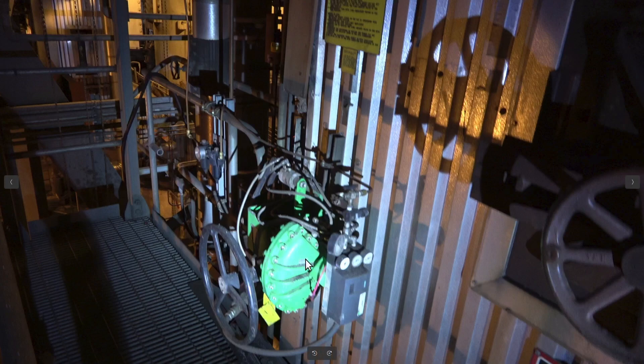This is the flow control damper — it regulates the airflow through the pulverizer based on the fuel and coal being pulverized. There's a minimum ratio; something like 60,000 pounds of coal requires about 160,000 pounds of air, depending on the coal and what you're grinding, but it's definitely a controlled ratio. If you get it too low, the pulverizer will start plugging up — the coal won't leave the pulverizer, just gets rejected and keeps piling up until it plugs. You'll see high motor current and high DP when that happens.